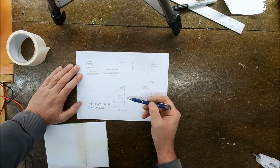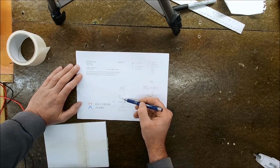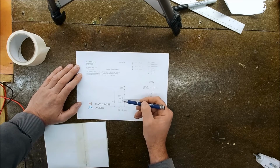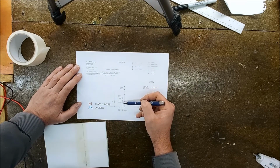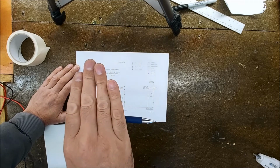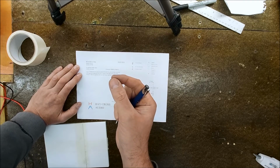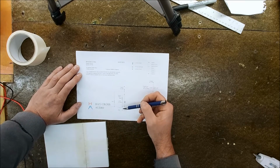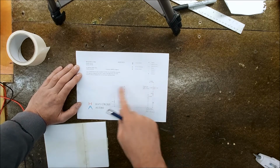Yeah, so we also have a notch filter on the woofer because there must be a lump in its response somewhere. And that's made up of a 40 μF capacitor first, and then a 1.4 mH inductor. But this had a very, very high resistance. And often, once you tune the circuit to the right frequency you want to pull down, you will use a resistor to attenuate how much you pull down. So the original inductor was like teeny tiny filament wire, which measured just over 12 ohms. So the inductor we've got is 2 ohms. So we're going to use a resistor before it, in between the capacitor and the inductor, to correct that. So yeah, we'll make that up as well. But that's what we're copying.